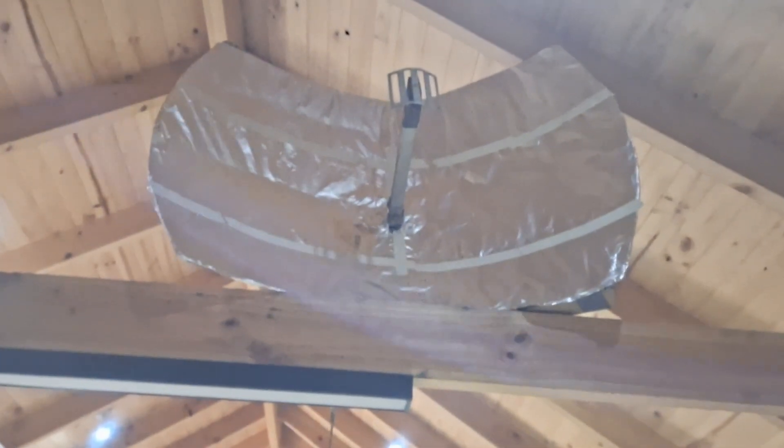And it works! Here's the finished thing — I covered it with tin foil and just stuck it on to follow the shape. It gets just enough signal to get one megabit, which is like the lowest data rate for Wi-Fi. But this is indoors, going through a wall, through four trees, and a house before it gets to the Wi-Fi point, doing about 160 meters. So yeah, it's good. Now I've got the choice of either going to buy a complete antenna because I know it'll work, or maybe getting a sheet of aluminium and doing what I did with the cardboard but with the right material and build my own reflector. But yeah — I have internet in my workshop.